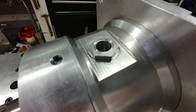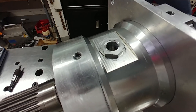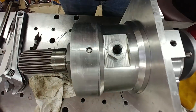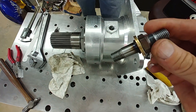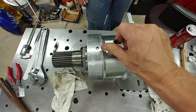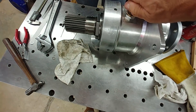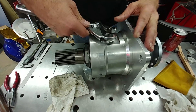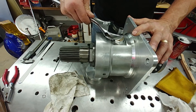You can see the nut with the recess that was done — that recess picks up the o-ring. Then you take that little fixture Brit welded up: it's threaded on one end, which was the first thing I was doing in this video. I've got the o-ring on there, a couple of washers, then the nut Brit welded on, and another thread on the other end screwing into the oil collar. It fits nice and snug. Brit's just using his crescent wrench there.